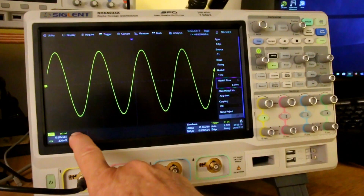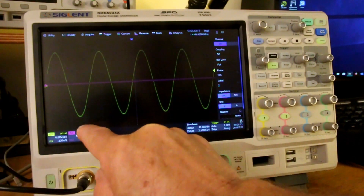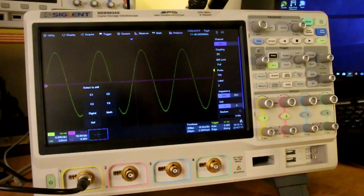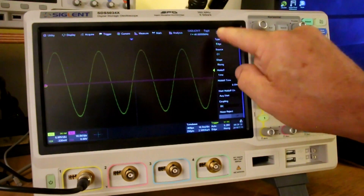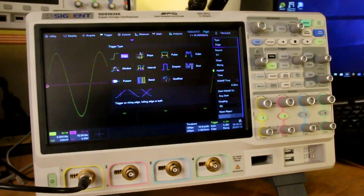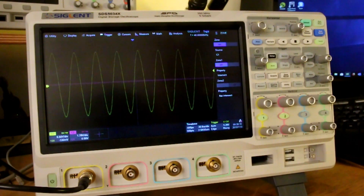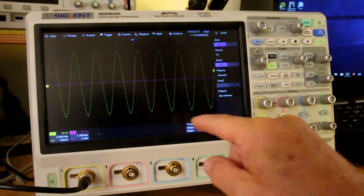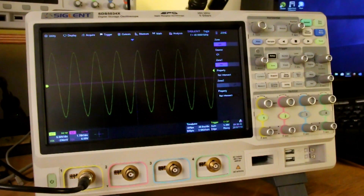I like this plus item here — it allows you very quickly to pick another channel which can be added, and that can even be a math or reference signal. The scope supports a number of triggering modes. One of the interesting trigger modes is the so-called zone trigger, which I see on some of the fancier scopes like the Tektronix. It allows you to draw a box on the screen in which the trigger happens. I find it's a little bit cumbersome to draw, but someone with more agile fingers would have no trouble, and there is a facility to enter the data numerically.